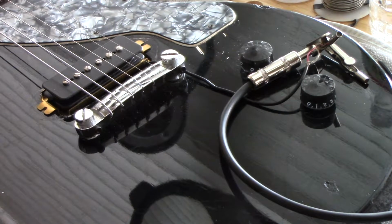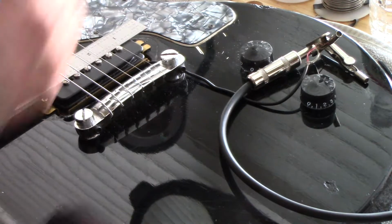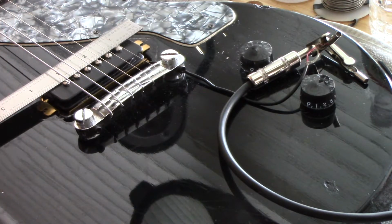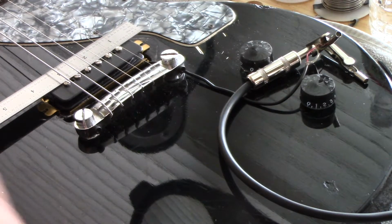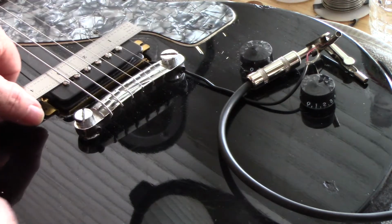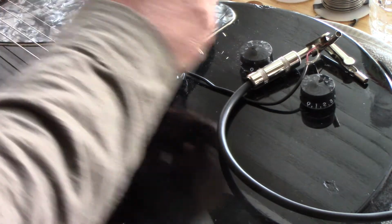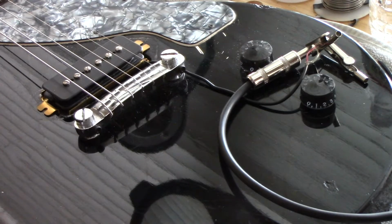So you can not only see that, and this is a thicker ruler, we've gotten a little weaker by placing the cover here. That's where the old myth comes from that taking your cover off increases the power. No, it increases what you hear. It doesn't change the power of the pickup, but it will change the tone. It'll darken that pickup up. And I know there's more volume, but if you can, you'll notice that you're getting a change in the tone.